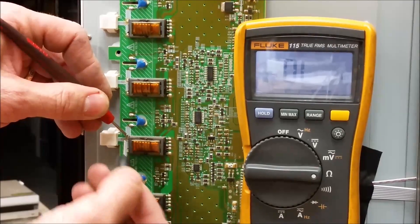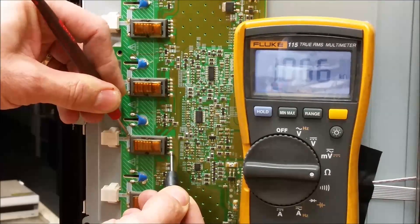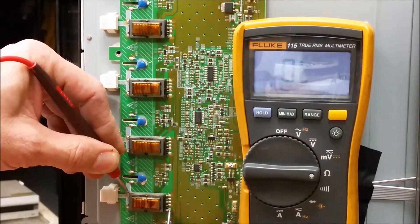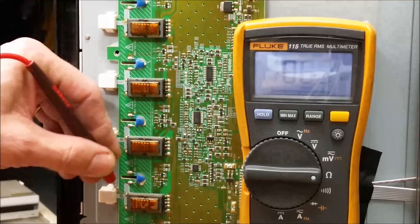One side of the transformer to this pin is the secondary, and that's what we're interested in. That one reads 1.06. Let's measure this one down here — there are a couple of little pads here I'll use for measurement purposes. 1.089. Let me cycle the light. And then this one: 1.471.